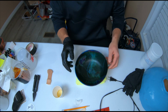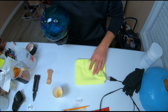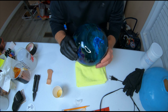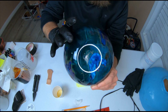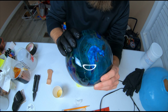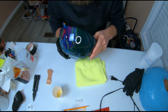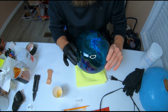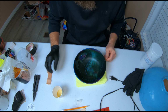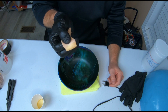A little bit better view for you. And the reason why I'm using this super bright microfiber cloth is I just put that finish on. This last coat I put on this morning, it's already good enough to touch. That's pretty good. But until it fully cures for 30 days, it's soft. All you gotta do, and all it takes is just a little bit right there.